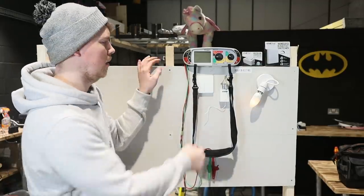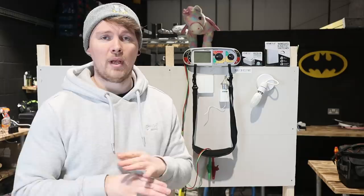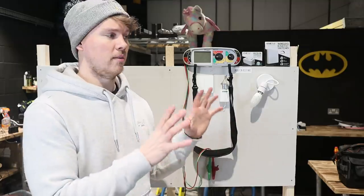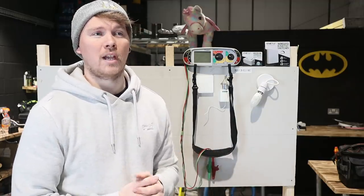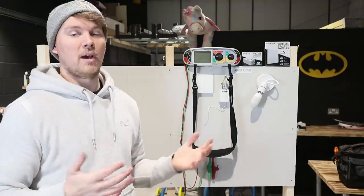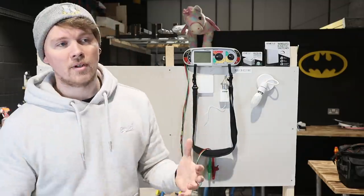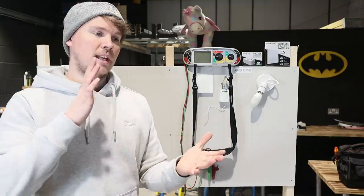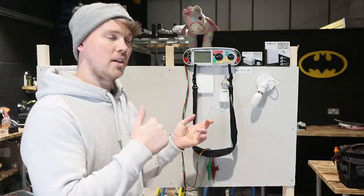On and off — no drama, no issue. A lot of people ask: with smart switches, if you've paired one and there's a power cut, do you have to re-pair? To my knowledge, not the case — not with Alexa or anything like that. With a simple manual pair like this, the power can be off for quite a long time. Once this switch is set up with this receiver, it's linked together for life. It runs off radio signals. Inside a kinetic light switch there's no battery — it uses your kinetic energy from pushing it, converts it into a radio signal which goes to the receiver.